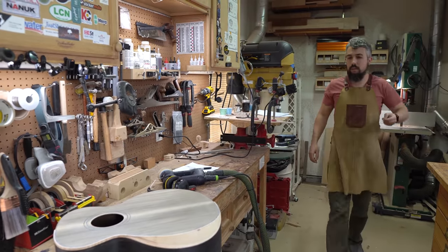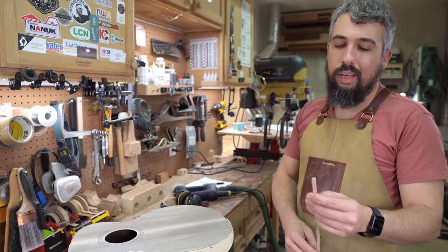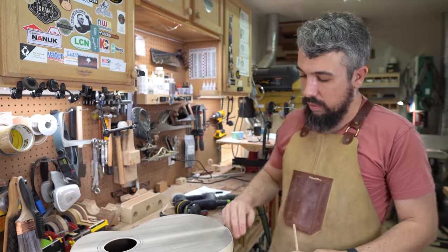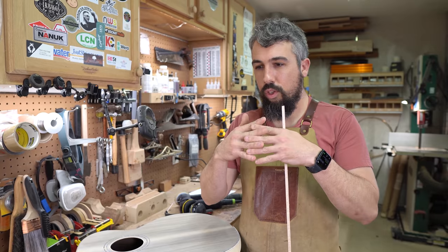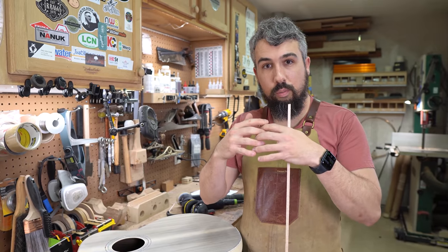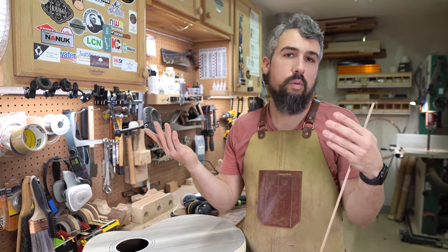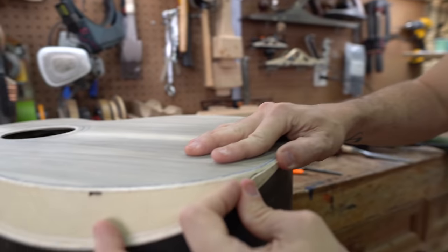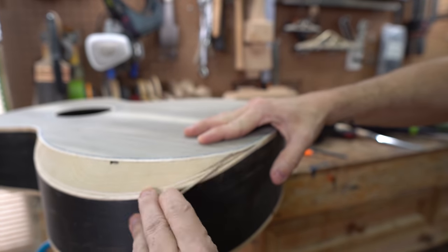Your backer material doesn't need to be the same material as your bevel. If you have some that's the same material, go ahead and use it. And the reason I say that is if you do happen to have some of your substrate material visible when you go to glue your veneer on, if it's made out of the same material, then it won't be as visible. Okay, so see what we've done here is it just kind of fits in there nicely, and we're just gonna slap it in place with some super glue and move on with our day.